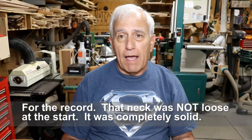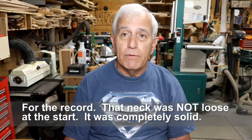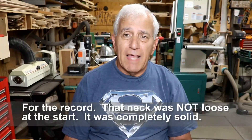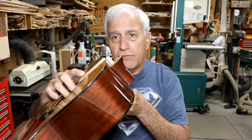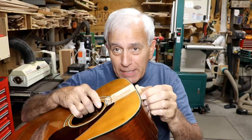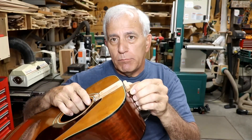You've seen me on camera take the neck out of a guitar I built with Titebond — 100% positive it was Titebond — and I took that neck out to reset it because I didn't do a very good job setting it up the first time. I got that neck out in 15 minutes on camera. An hour and 45 minutes into taking this neck out — glued with hide glue — I started getting a little bit of movement. It was starting to wiggle more and more, so I thought okay, it's going to come loose.